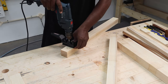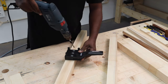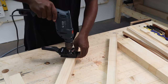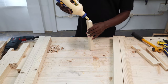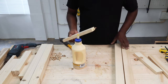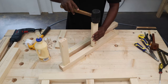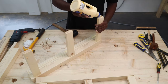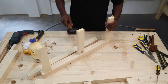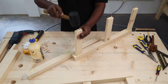The next step was making the dowel holes at the locations marked using the centering jig. We used the same drill bit we used for the bracing pieces and drilled dowel holes in all the locations marked earlier. Then we filled each dowel hole with wood glue and hammered the correct sized dowel pins into the hole. We first fitted the pin into the bracing piece and then used the hammer to push the dowel pin into the leg piece, completing one dowel joint. We used the markings done earlier to identify the right pairs for joining together.